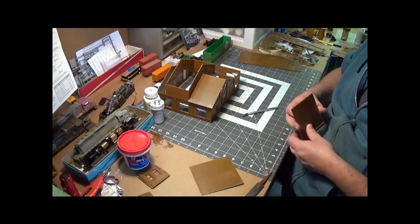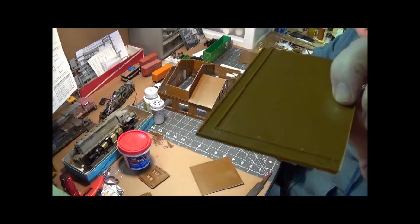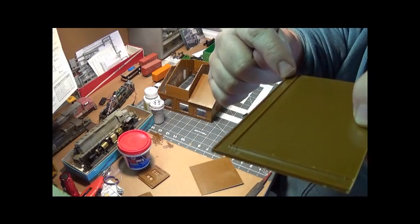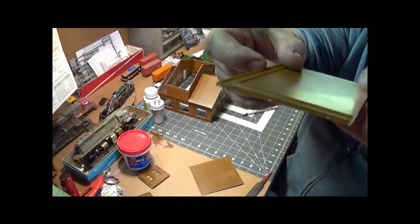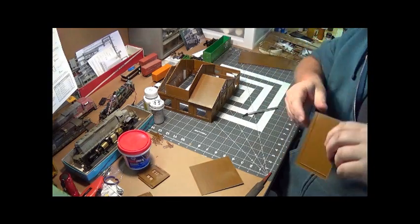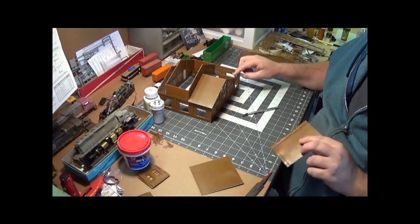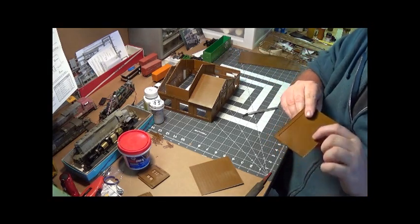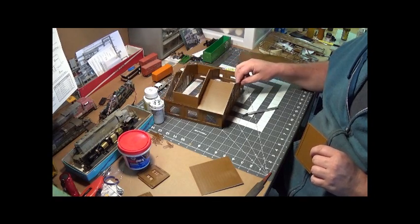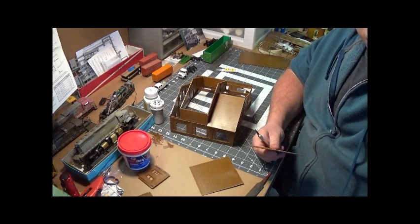And that's that. Okay, so now you see the grooves on the bottom and on the side over here. This groove on the side over here will have to be sliced off flush. And then I'll have to cut a notch out of this top piece here so it can ride on the inside brace. And so this notch down here can actually clear this short piece of roof right here. I will cut away, I'll slice those off, and I'll show you exactly what I'm talking about.